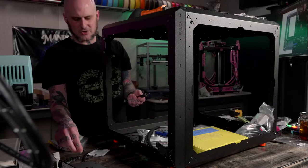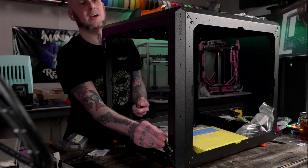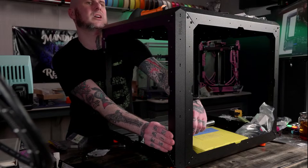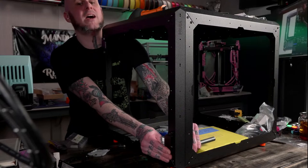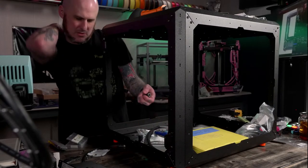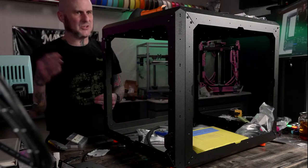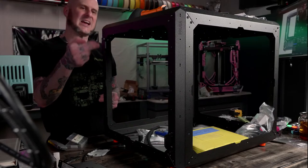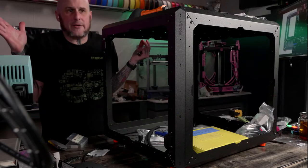A switch wire conversion where you use a Nintendo Switch instead of a Raspberry Pi. No, but I compiled firmware for the 5-inch X-Touch. Okay, well then, you probably have all the compile experience you need for Klipper. That's not a problem. The configuration is what tells the firmware what pins on your board to look for. Like, this is the X limit switch. This is the Y limit switch. It doesn't know without that stuff.